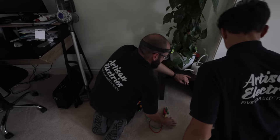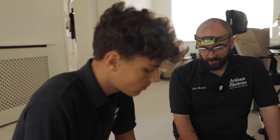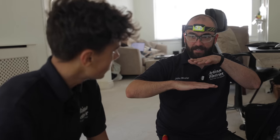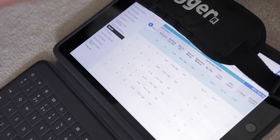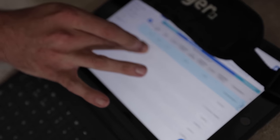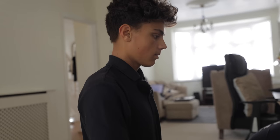Do you understand all the boxes on this? The number of points is a bit irrelevant. Reference method is very difficult to tell — that's the way the cable's been installed. How are we supposed to know how it was installed in the house? This could put a limitation on it, but the reference method tells you how much the cable can actually handle. So if it's running through a loft with two layers of insulation on it, it derates the cable. That's very important because it tells us whether that cable is suitable for that breaker — the breaker should be the weakest link so the cable is never under strain.